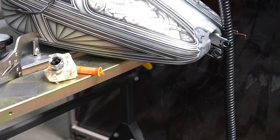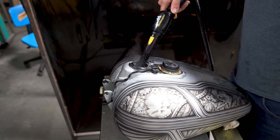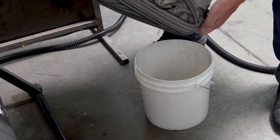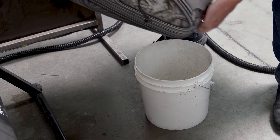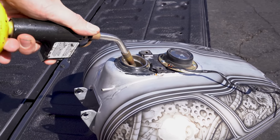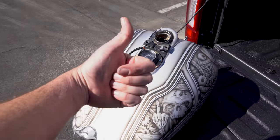However, it's kind of silly to expect an engine to breathe through a three-quarter or 19 millimeter hole like the one for the fuel valve — on large tanks, maybe. You can also purge the tank with argon, but it's best to completely degas and defume it to the point where it simply doesn't light on fire anymore. I have a link to the steamer in the description and it's a really handy tool to have in the shop either way, so consider it.